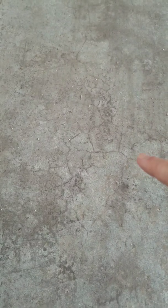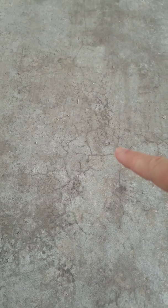This is a floor where the wood was all moldy and the room actually smells like mold, so I think there's probably more of it in these walls than we know about. Right here you can see these little fissures in the concrete and you can see the little dark areas around them that have moisture coming through them still. This floor was removed probably almost a week ago now, but it still isn't dried out. I don't know that it will be, because I think there's a big moisture problem underneath the foundation — that's been the cause of this whole problem. That's my guess.